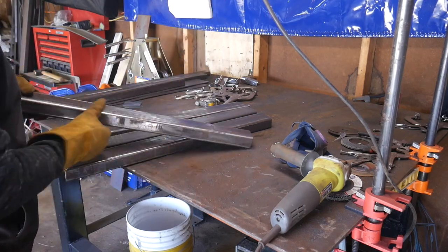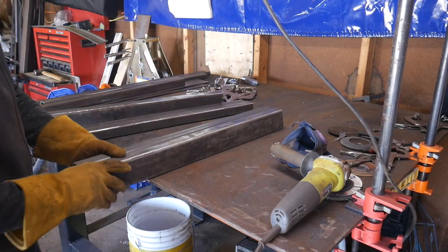To find all my angles I use SketchUp, and then I use a scrap piece of 2x4 to transfer those angles onto the metal — you can't trim metal as easily as a 2x4 so I do a quick mock-up beforehand. I use the same 2x4 to set my blade angle, which is just less worrying when actually cutting the metal. I'm making note of the metal seam and ensuring that's on the inside, as you do not want that visible on the outside of the leg.